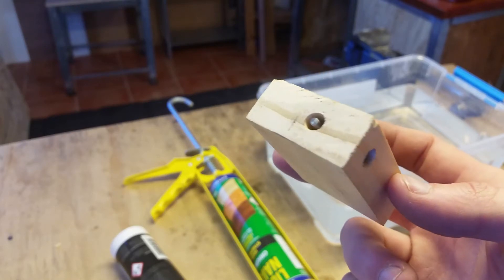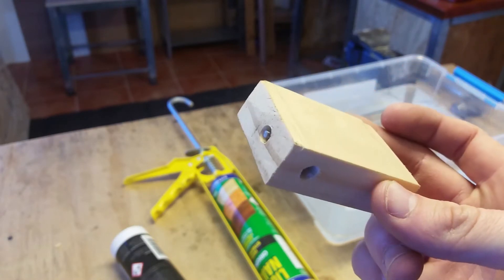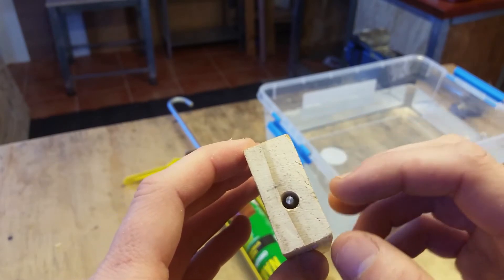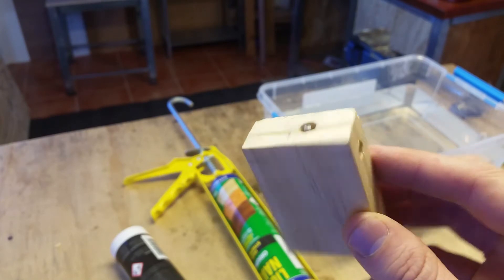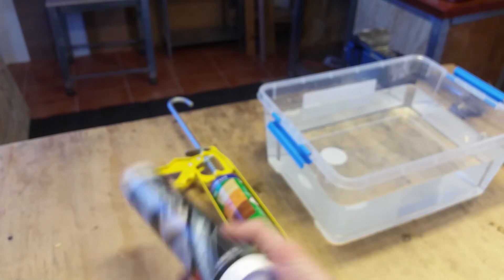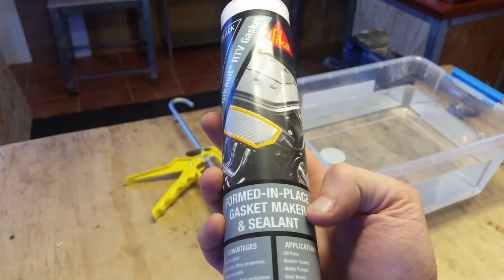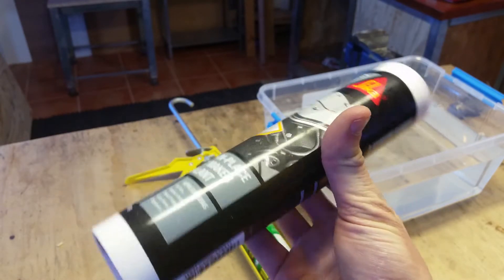One of the most watched videos on my channel is when I tried to make a silicone hose using a little extruder like this. Basically it's two holes drilled at right angles, and in one of them I've cut the end off a nail, polished it off a bit with sandpaper, and hammered it in there. It didn't work very well last time because I used everyday bathroom kitchen grade silicone. Someone suggested in the comments I find some high temperature RTV gasket silicone, and I got this for a pretty reasonable price — apparently for forming gaskets in place in engines and covers and stuff. So this should be able to handle fuel and high temperatures.